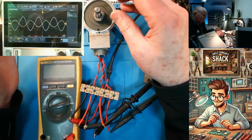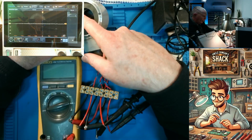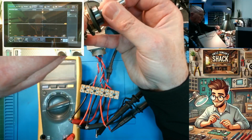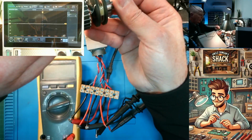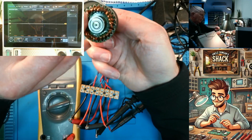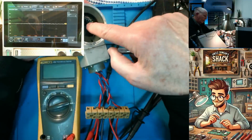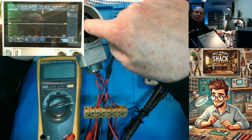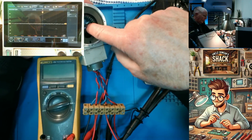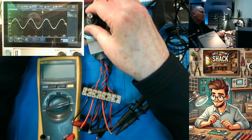You've got magnetic coupling. Okay. Your excitation over here, which is what my frequency generator is connected to, the primary winding, through these two rings, couples to that winding over there. Alright, that winding is electrically connected with these wires to this secondary over here, which is 6 poles. Alright, as we thought initially, 6 poles. That couples down there with two windings which are 90 degrees out of phase. Your sine and your cosine winding, okay? Sine and cosine, they're 90 degrees out of phase, and gives us the two signals on the scope like that.